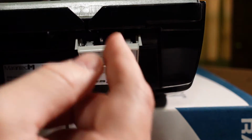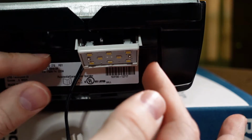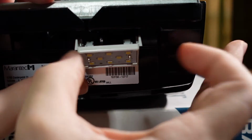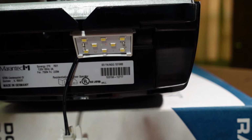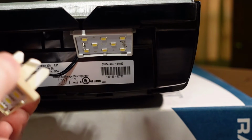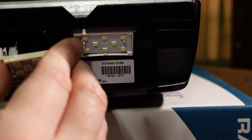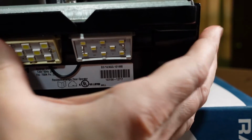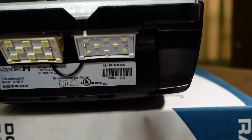Okay, so you want to take the wire that's coming from the opener, push as much as you can back into the opener so it's not too bulky, and then you'll see slots in there. And you'll want to have the small sides of these on the top, the longer on the bottom, and then you'll put them in the slot and then push up on the outsides until you hear a click, and then those are in place. So now again, now we put the second set in. See the shorter ones go toward the top, the longer are at the bottom. The ones on the bottom will slide into the slots. And you push them up until you hear a click and you're installed.